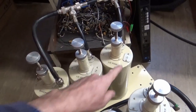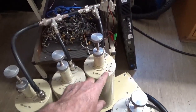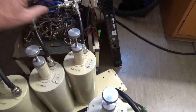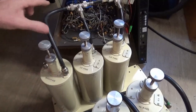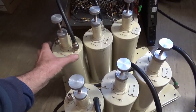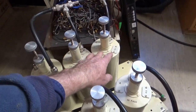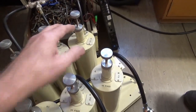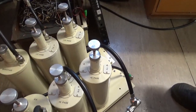On the transmit side, that's where the transmit aerial goes into that port. This is low pass, single loop — these are tuned lengths too. The bandpass filters are unmodified, and the tuned frequencies of these are designed to reject — because that's the transmit side — designed to reject the receive side. And the receive side of these two is designed to reject the transmit. That gives you, between the two, as much isolation as you can between transmit and receive.